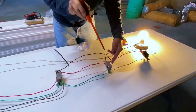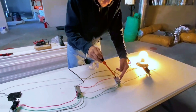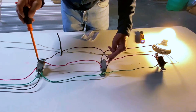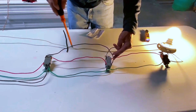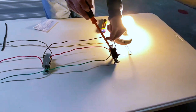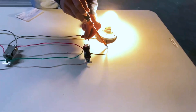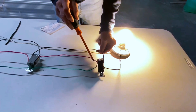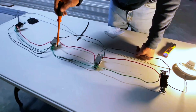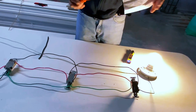I'm making this a little more complicated because I've got two four-way switches in this circuit — just giving you a full detail of how this works. Coming in line side on the second four-way, same thing: take the red wire straight across, and the black wire comes from underneath the common. Coming load side out, I bring my black wire to the common on the final three-way switch. It's very important that you ground everything, because these are metal switches going into metal boxes in a commercial building.